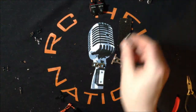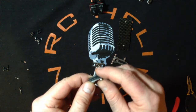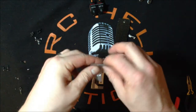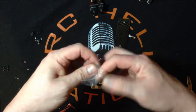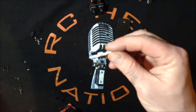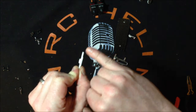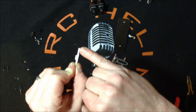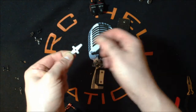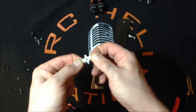Okay, and here we are with the next step finished up. We've got the arms ready to go. And what I found was that these servo arms that came with my BS92A servos weren't flat. They have a bit of a lip where it's thicker here towards the center and then thinner here towards the outside. So you have the option of just using the servo horn as it is. It looks like a lot of guys are doing that and having no problems. These are actually pretty tough.